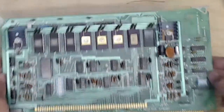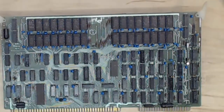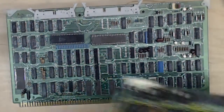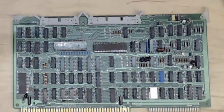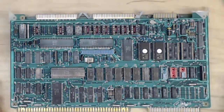Here are a couple of ROM boards. I've also got a Multibus RAM board — a 32K RAM board. I don't have the equivalent in an S100 sitting here. Here's a floppy disk controller card, and here's the S100 version — a CompuPro floppy disk controller card. In a later video, I'll talk about shopping for an ISBC. And if there's enough interest, we'll dig in and start looking at programming the USART, programming the I/O, writing monitors for it, and exactly what you can do with this to have a fun afternoon.